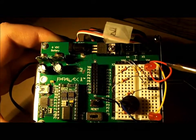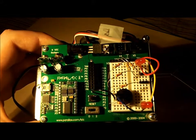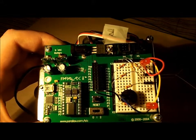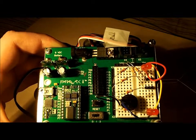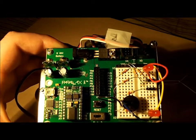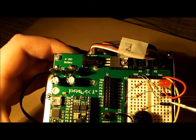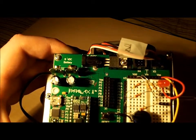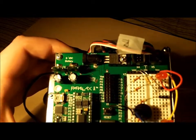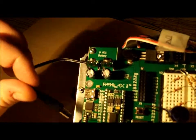It switches the bit from on to off — it's a basic binary registry, pretty cool. I have it set up where these LEDs also tell me which side was hit. The code I have running would allow it, if hit straight on, to do a reverse and U-turn. But I'm finding it hard to get the timing right, because if one hits before the other and they don't simultaneously make and break the current, it only picks one side.